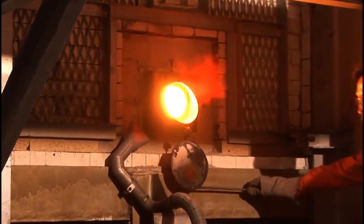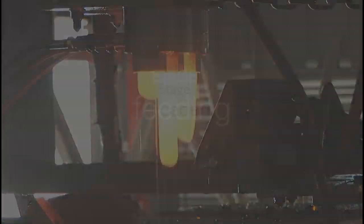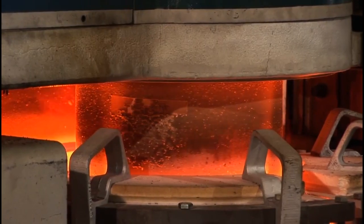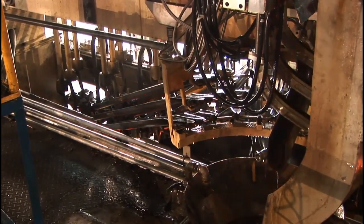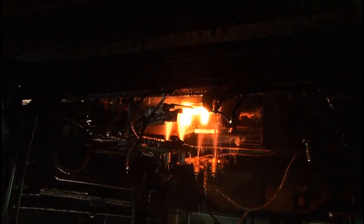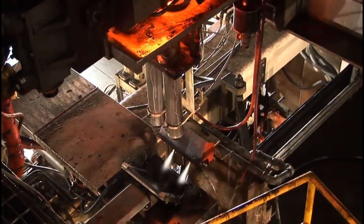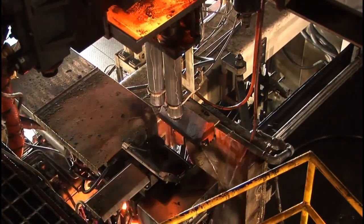At the end of the cycle, the glass is forced through a ring. In the next stage, the molten glass is cut by shears — this all takes place in the feeder. Careful, these suckers are hot! The shears cut elongated cylinders at precise intervals. These cylinders are called gobs, which have just enough glass to form a bottle. Then they are moved to the forming machine.